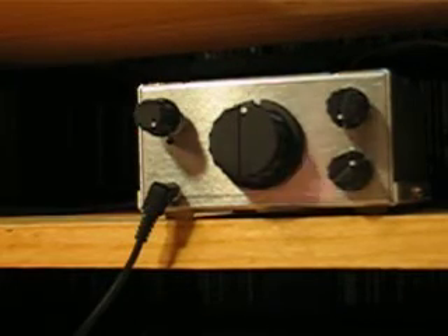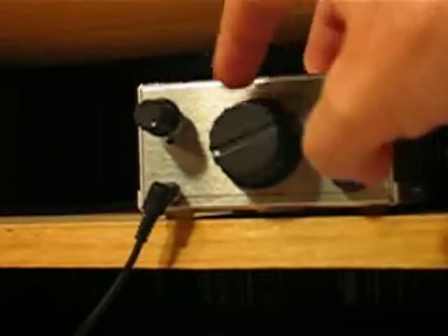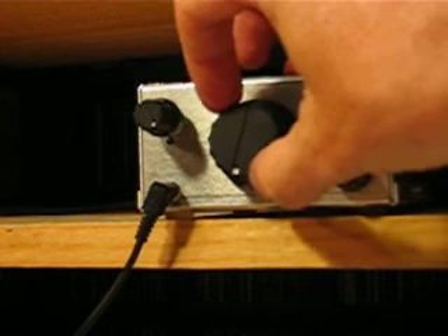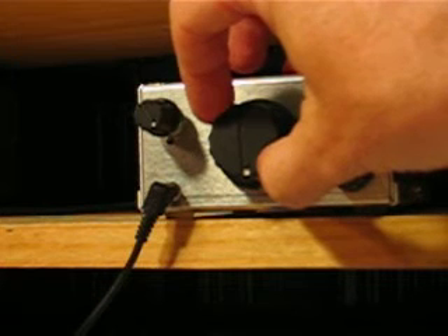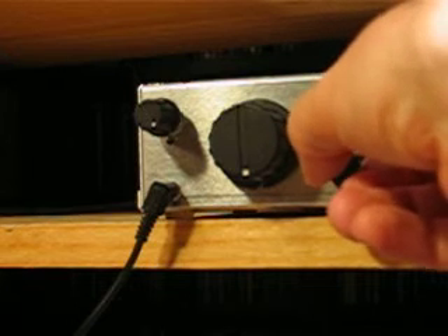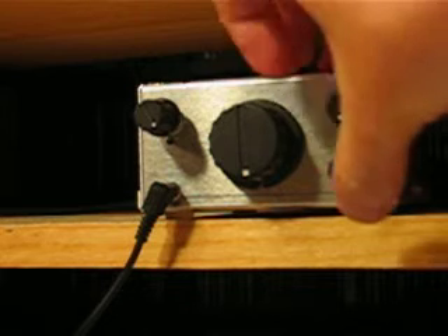So this radio, actually at the top end of the tuning range, it's just above 10 megahertz. So let's tune it down until we find WWV. And there it is. I've adjusted the radio so it's just on the threshold of oscillation, so it sounds quite narrow as you tune in and out of signals.